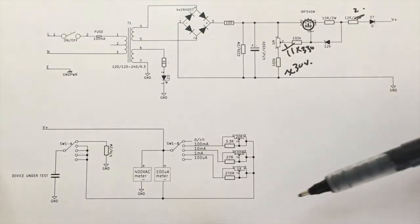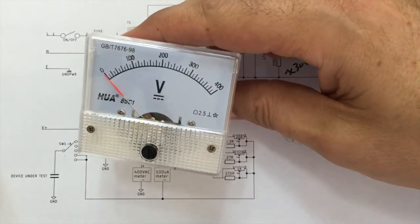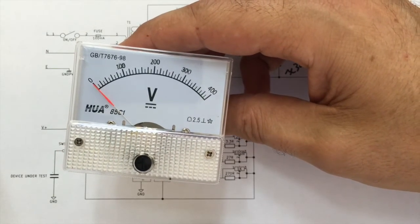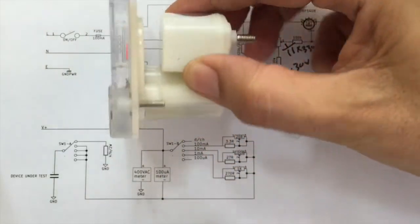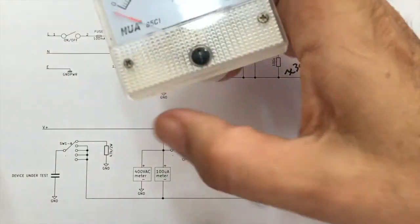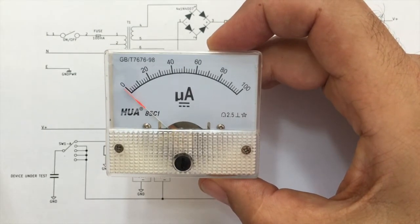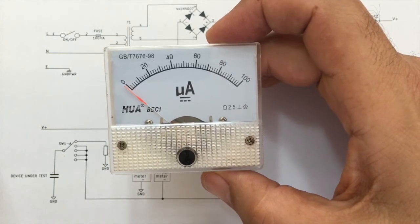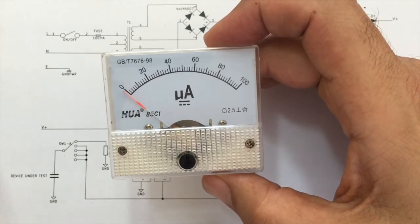Now the interesting part comes next — the metering system, the circuit used to measure the current and the voltage. The meter I have here is the voltmeter I'm using — it's a 0 to 400 volts DC meter. Its accuracy is not critical, but it's 2.5 percent accuracy — it's quite a good movement and I'm quite happy with the result. I found the equivalent ammeter: this is a 100 microamp full-scale ammeter which I'm going to use to measure the leakage current. So 100 microamps means the lowest reading I'll be able to see is just a twitch at the bottom — maybe one microamp. I would have liked it to be lower, but I don't want to multiply the readings to get lower values.